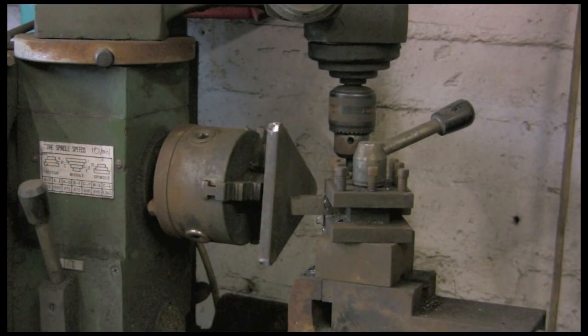Right, we've got it cleaned up, taken the corners off, and I've welded a little lug on the back of these jaws because I've only got a tiddly little lathe and it won't hold them otherwise. So we're going to run them up now and just put some grooves in and see how it turns out.